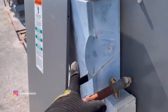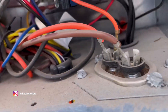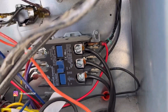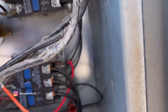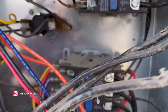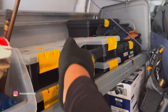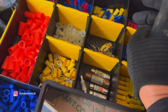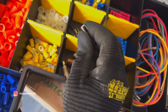None of the fuses were tripped. I went ahead and turned off the disconnect. Just by checking my wiring, we got some burnt wire going on right here. They have it jumped from the other contactor, and we got a burnt wire. So I'm going to repair that for now. I'll check the contactors and we'll get that going for them. We probably got these connectors at Lowe's — I like that they stack and they never fall off the shelf.